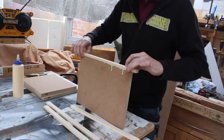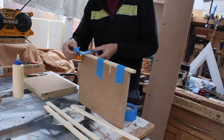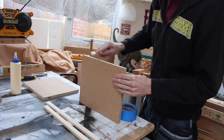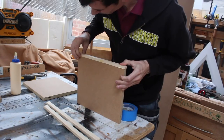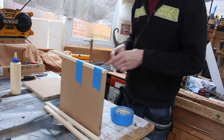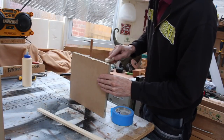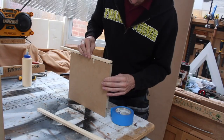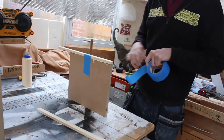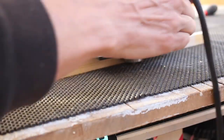A few of the shelves I wanted flush with the front, so I had all the shelves cut to the same depth, which was about 5 or 6mm too short. So I'm putting a bit of edge lipping on — solid timber — just gluing it on and taping it until the glue holds. No dominoes or biscuits, because it's going to be trimmed flush both sides, so I don't need to worry about it being tapered.